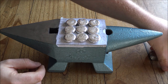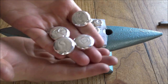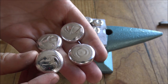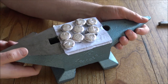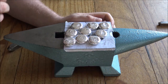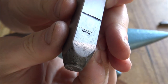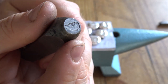The next stage is the stamping process, which is one of the hardest parts. You might think the pouring of the silver is hard, but stamping is a learned skill that I have definitely adapted my technique on over the last couple of years. Here are the blanks — all ready to go, no cleaning required, the silver is as clean and lovely as possible. I would highly recommend any fledgling silver stampers to get themselves a big heavy anvil, or at least something with a lot of heft and weight to it. This is a steel one and all the energy you put through the stamp goes straight onto the silver. M. Shaw Engraving made this stamp — they are a very, very good stamp maker with a very flat-bottomed design, which is why we need a big heavy mallet and anvil to absorb the blow.